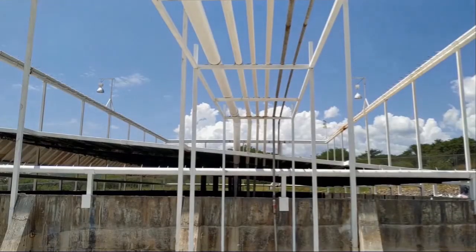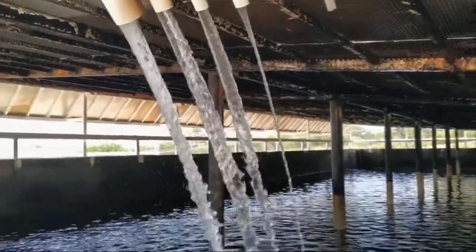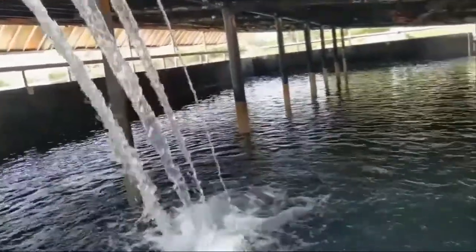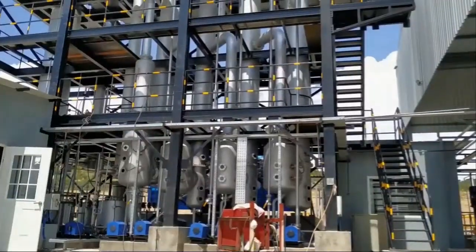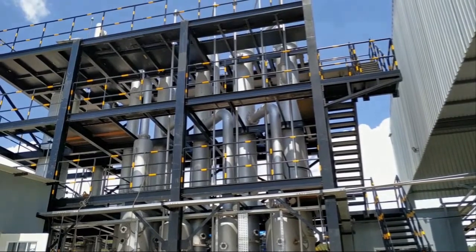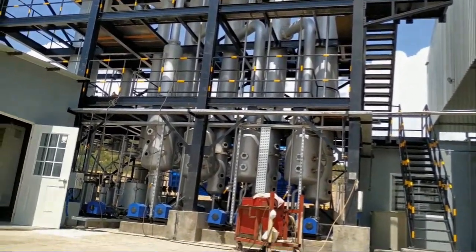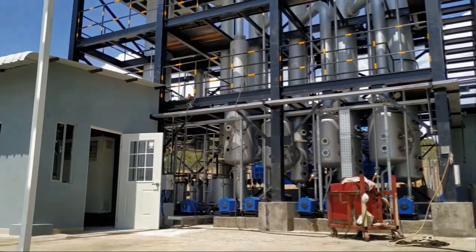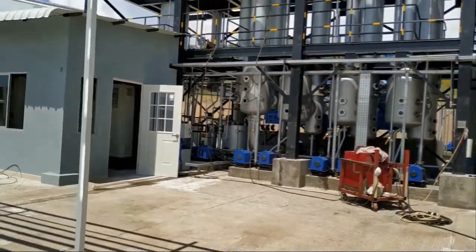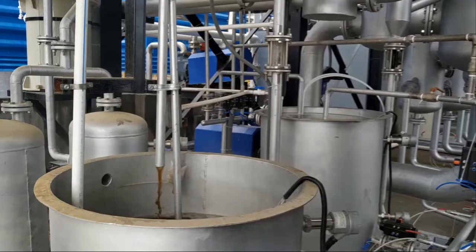The plant produces an average of 67 cubic meters of reusable pure water from the waste water. The 4% reject from RO stage 4 is further treated with a multiple effect evaporator. The MEE is a tube and shell heat exchange system using steam as heating medium. The high saline RO stage 4 reject is evaporated and condensated in an energy-efficient way, recovering 3.6% of the water.